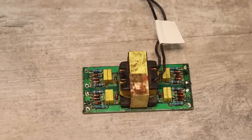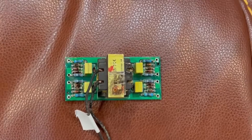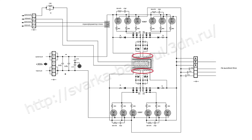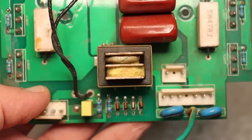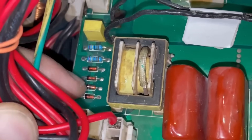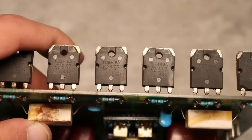Diagnostics show no serious anomalies on the gate circuit board. The 1N4148 diodes were replaced just in case, as there was a slight variance. It's also worth checking the integrity of all secondary windings of the isolation transformer as well as the primary winding. On this board there is also a current transformer whose secondary winding should be checked, along with a rectifier installed on low-power diodes. We prepare the mounting spots for installing the new transistors and set this board aside, as the transistors haven't arrived yet.